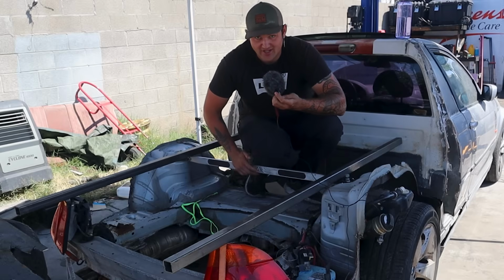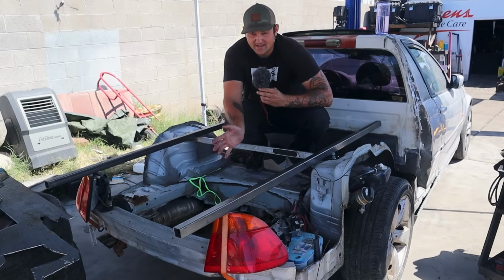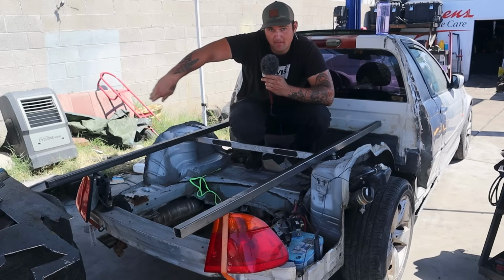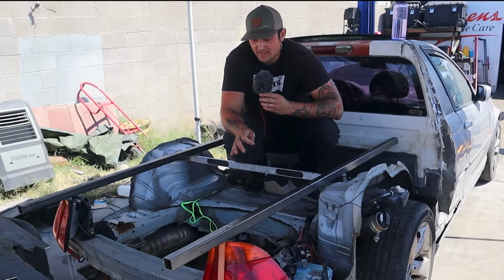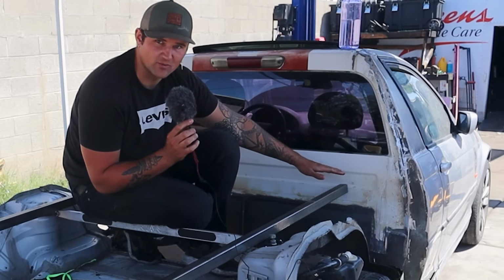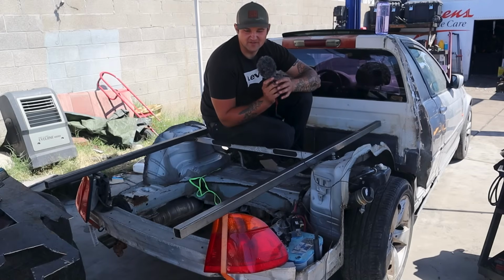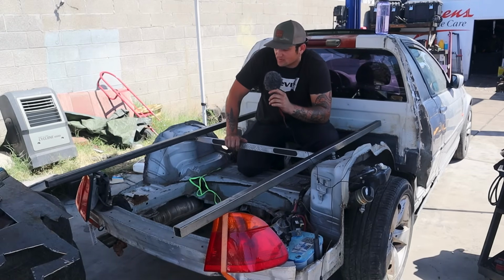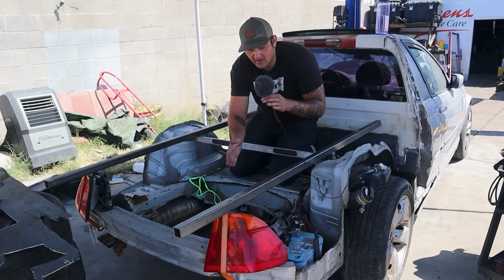And I've been doing a lot of research on how other people built flatbeds for trucks, of course. It seems like the strongest way is to run right along the frame rails and then do pieces on top. But for me, that's a tough one because it's going to increase the height a little too close to the window, because I would like a little bit of gap, and of course I'm going to build a protector, but it just adds a level of difficulty. So I just don't think I could do it that way, even though I would like this to be as strong as possible. So we're going to do these two slats, support them straight on the frame rail,